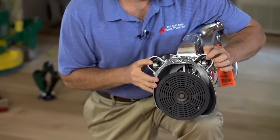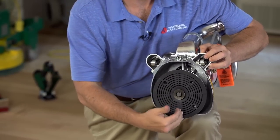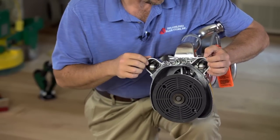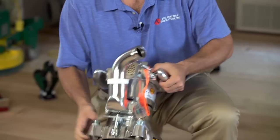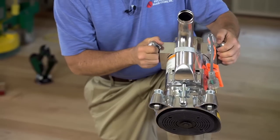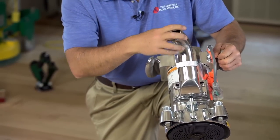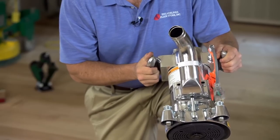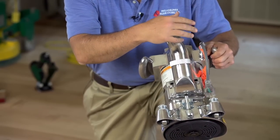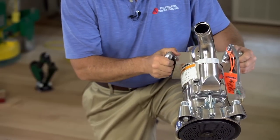It has individual casters. Depending on how you want the machine to cut, you would adjust the casters up and down individually. It has a newer style dust stack. This will use both a bag or a vacuum hose if you want to go dustless. With a large fan and an incorporated hose for a separate vacuum system, this unit would then become dustless.